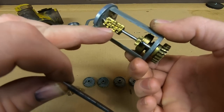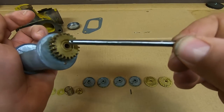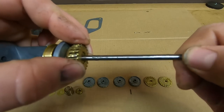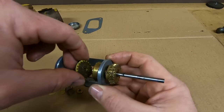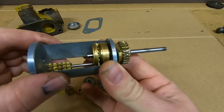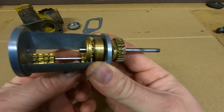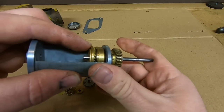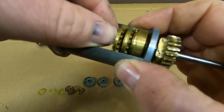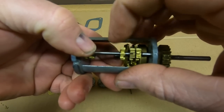To begin assembly, I've got some grease on these pinions down here — that makes life easier, holding the ones out of the way that you're not ready for yet. Otherwise they're sliding all over. A light coating of assembly grease on the main shaft as well. We'll start that in, put the first bronze disc on the end of the shaft. You don't have to worry about where these are clocked because it just takes a few manual revolutions of the drive gear to get them where they need to be. We want to alternate: disc, pinion, disc, pinion.